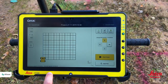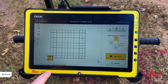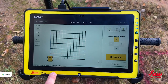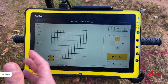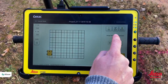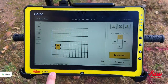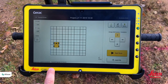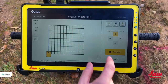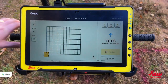We hit 'Go to Acquisition', connect to the DSX, and now we get an overview of the grid that we need to walk. The little yellow icon in the corner represents our DSX. We can change the position of the radar if needed — for example, if there's a parked vehicle in the way, we can navigate the DSX around it in the software like a pac-man to correctly orientate it around obstacles. Then we hit 'Start Scan' and push it forwards.